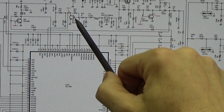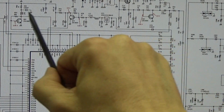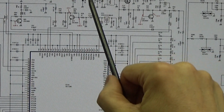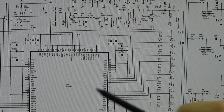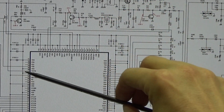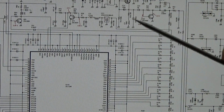And yeah, now it is very simple. This ref frequency gets compared with this feedback frequency from our little VCO, right? And the output of our PLL IC, we have already said, is the up or down signal, and this comes out here and goes to the input of our VCO.